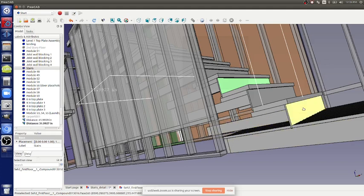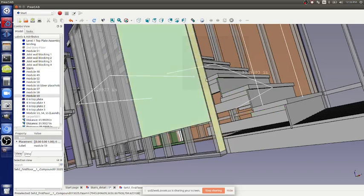And for the first stair, you can attach the back. The only attachment which you don't have is here. Put a 2x6 under. Put a 6x6. Let's get that stub of 6x6 we have on the site. Just put it under, lay it on there. That's finished detail. Let's not worry about that right now. Let's get the stairs. There's a bunch of detail here because we'll probably use 1x4s to finish off this side, but right now this side is exposed here. It's hidden behind the walls, that's good.